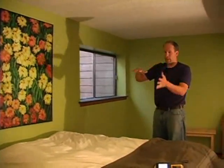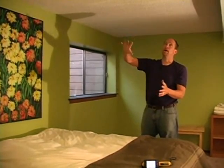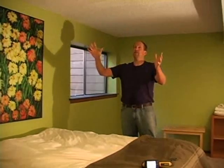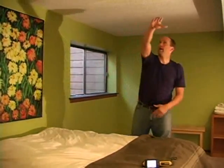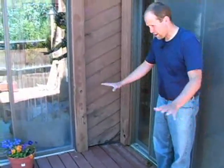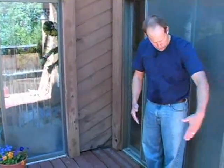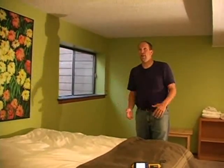And then actually we'll go back up outside. When we came down, we realized that we're going to be partially underneath the deck above us. Actually, this is an interesting house. Outside there's a deck. When you go out the rear slider door, you walk out onto a deck which is above this finished area right here. And it's not covered. So when you see an exterior deck that's not covered, it has a flat roof under it. You have to be concerned about what's underneath the deck, what's underneath the roof underneath the deck. And it's this bedroom ceiling.